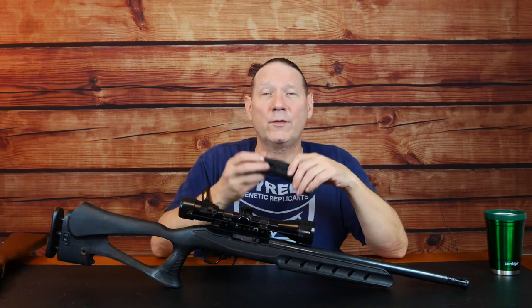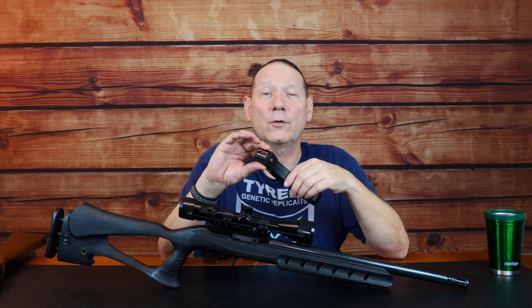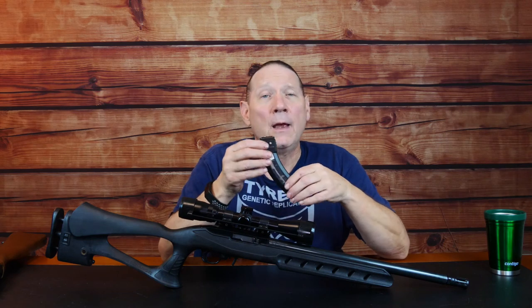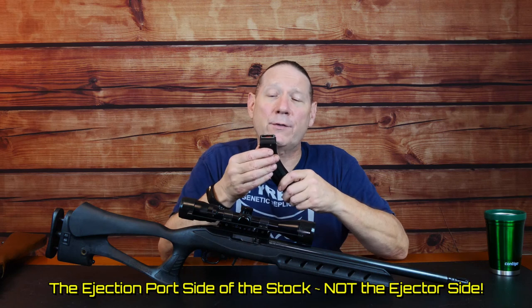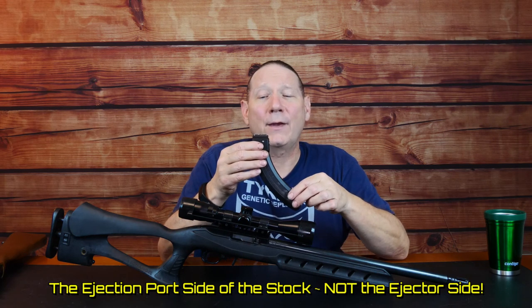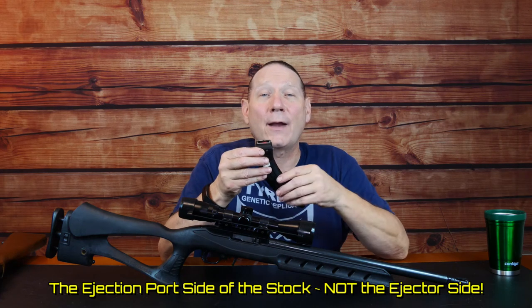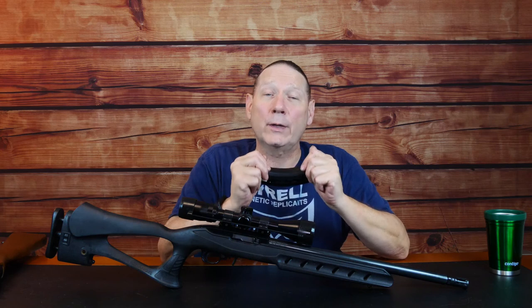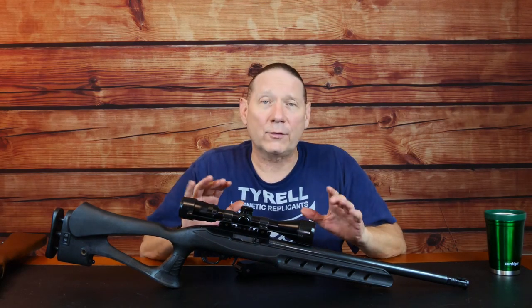Another thing that we did that had a huge impact was the BX25 magazine doesn't fit nearly as tightly in your factory stock or an aftermarket stock like this Archangel. So it has side-to-side play in it, and I took the ejector side, built up the inside, to where the magazine was biased so that the ejector was closer to the center line of the bolt head, and that had a huge impact on decreasing the number of failure to ejects. So those are the two biggest fixes.